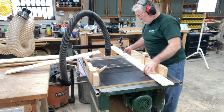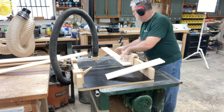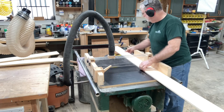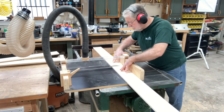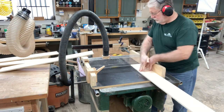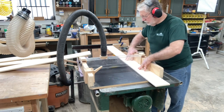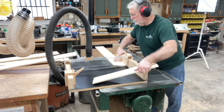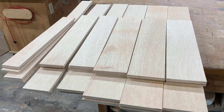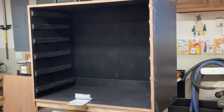It's now time to build drawers — and there are six of them. I have one four-inch drawer at the top, then two five-inch drawers, followed by three six-inch drawers. The good thing is the width on all of these drawers is exactly the same, which makes it easy. Once I have all my boards cut, getting them to the proper length is very easy — I can set the table saw up one time and make the cuts. I have that little stop block installed on the fence, which is very important because that one small piece of wood clamped to the fence really does prevent kickback — a big safety feature in the shop.